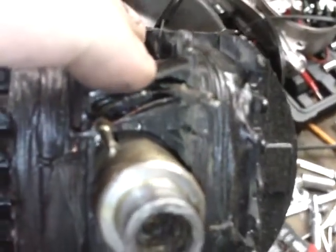Here's a rotor out of a brushless generator — it doesn't have slip rings, none at all. It does not have brushes. Instead, down inside the rotor on both sides there is a resistor and a diode.